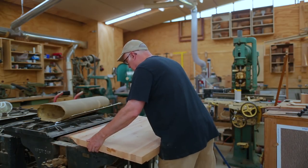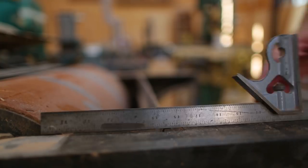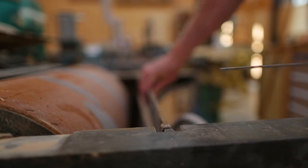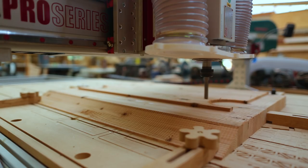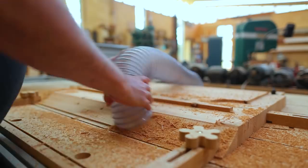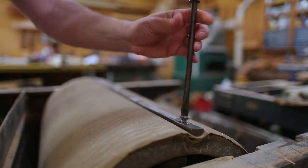The tables fit but didn't quite sit flat. I figured out there's a little panel that fits next to the drum that doesn't slide all the way down flush with the supporting surface of the sander. I cut out a little more of the table to make space for that panel. One thought was to grind the panel down, but I didn't really want to damage the sander, so I modified the table instead.